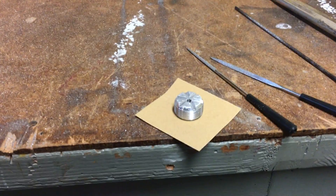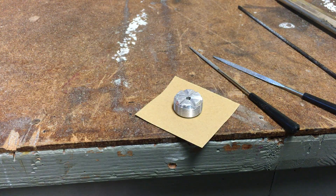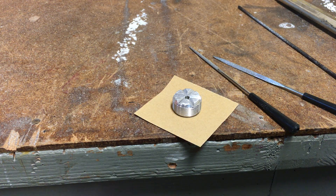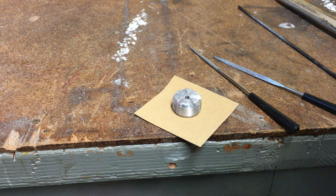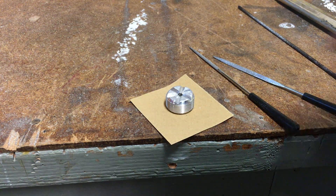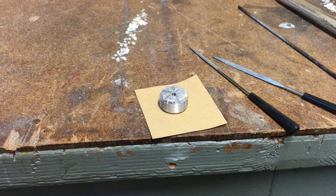You're already eliminating surface area by grinding it down, so this gives you the best surface area for your LED to mate up to the heatsink. These modules run about 10 bucks with free shipping from LEDsupply.com, and the Cree XMLs are about five or six dollars each. All in all, if you already have the other stuff, it's about 15 bucks to set one of these up — maybe 20 if you need to buy a resistor or wires. If you have a different way to do this, please share it in the comments because I have two more of these to do. Thanks for watching.